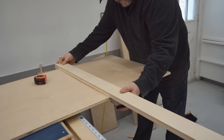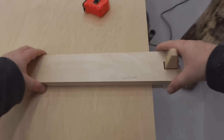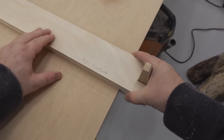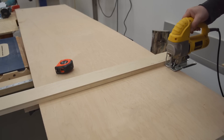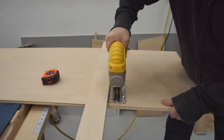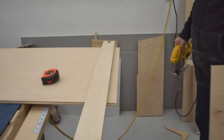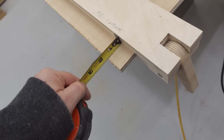Next, I've got a narrower piece of half inch plywood that I need to cut, and sometimes the jigsaw is the only tool available, so I thought I would give it a try here. The jigsaw vibrates a lot when you're using it, so it's a really good test to see if the fence will move while you're making a cut. And again, I could measure and mark the offset for this tool as well if I was going to use it often.